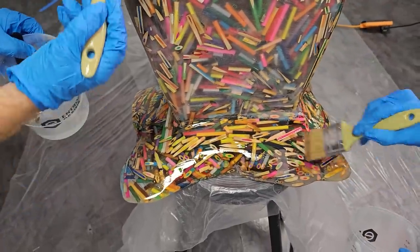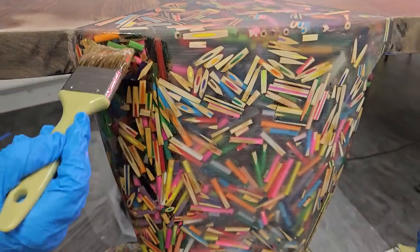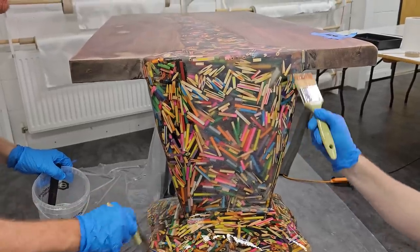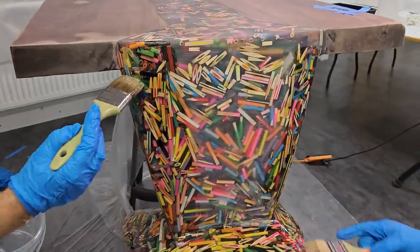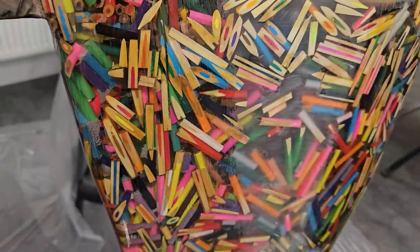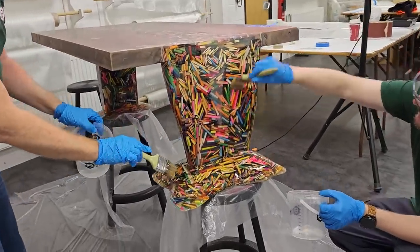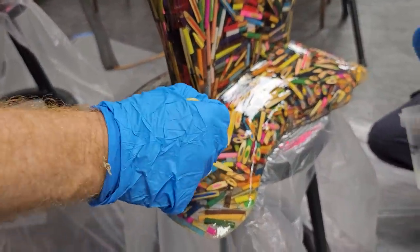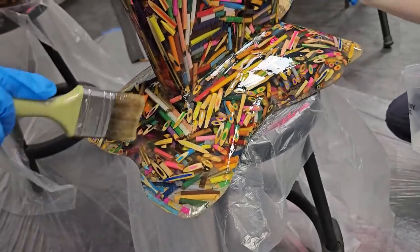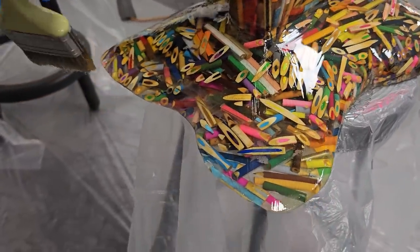This will run on the vertical, so you know, brushing it down like this — you can do that for a long time because it's got no solvent in it, it will brush out really nicely. You can watch this — get the light against it. Initially you brush it out quite hard; you want to bend the bristles of the brush to pop the air bubbles. Look at the brush lines — but watch how they just blend in and completely vanish as it flows out. Tiny little brush hair there. Looking beautiful. Just warm it slightly to remove any air bubbles.